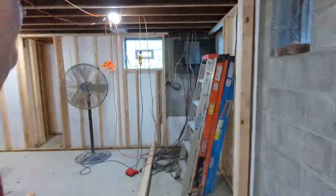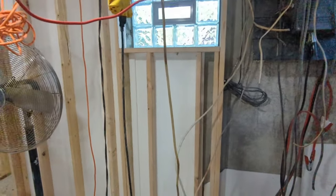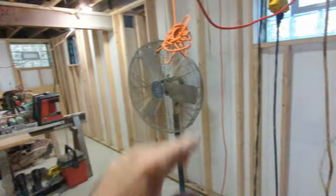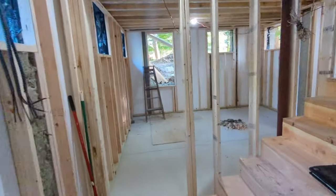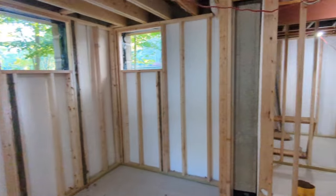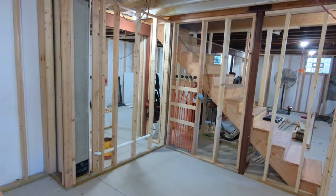And then I can go right in here with my drywall router and route these openings after the drywall is up. I'll just put a big hairy X on the locations if I can't remember them, then go in, find the edge, and go around with the router. It won't harm the framing lumber to bump it. That way we won't be cutting and fitting almost anything here. Certainly the electrical outlets will have to be cut and fit, which brings me to the next thing. This is not what the episode's about, but I'm thinking about this stuff now.